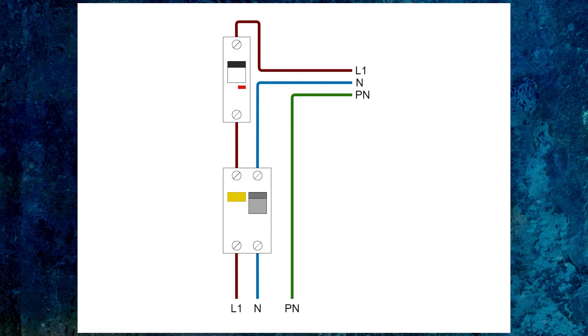How it does this is it measures the amount of current flowing through the phase conductor and the neutral conductor, and if it senses any current missing — which means a current leakage — then it interrupts the power supply. This leaking current could potentially be flowing through a human body, which is of course dangerous, so these can save lives. This is a 30 milliamp one, which means it will trip if it detects a leakage of 30 milliamps. A 10 milliamp one is used in schools and medical areas — they're a lot more sensitive and you get more nuisance tripping, but they do offer additional protection.